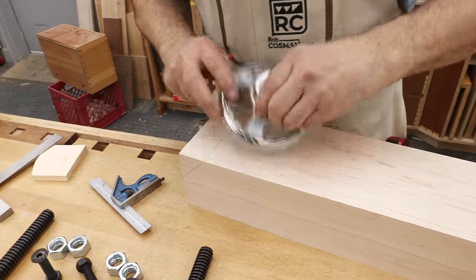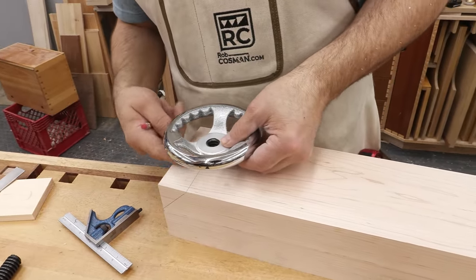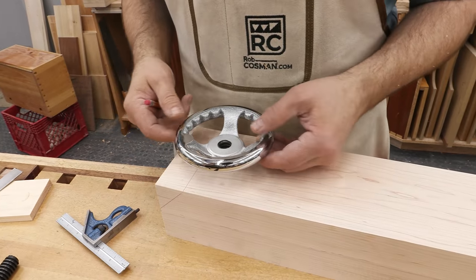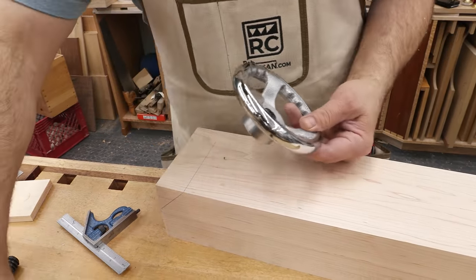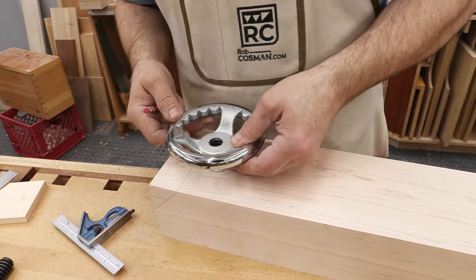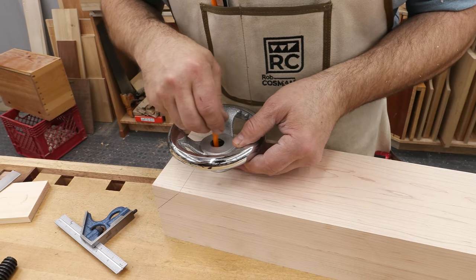So we want to keep our flange on a flat surface. We don't want that sitting out somewhere in that bevel. So I suppose if we put it right about there, actually we better put that washer on because that's what we lean against. Actually the same diameter, so it's okay. So I'm going to say right about there.